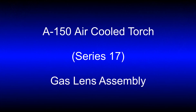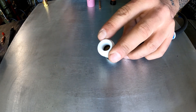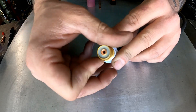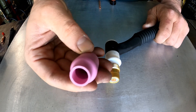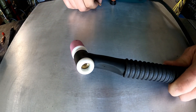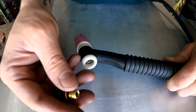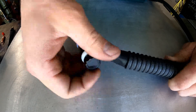I'm going to be showing you another setup here with an A150 air-cooled torch, or a series 17, with a gas lens. The first thing I'm going to do is add an extra insulator to the outside of the torch. Next, I grab the gas lens and thread that into the torch as well. You can see that even when the gas lens is on, there's still a little bit of play between the two insulators — but the cup will take care of that issue. Next goes in the collet, skinny side down. And last but not least, we put a stubby back cap onto the gas lens torch.